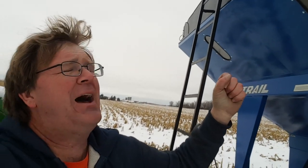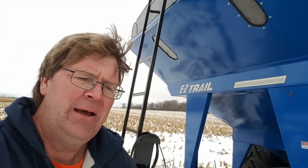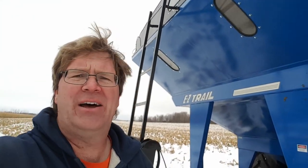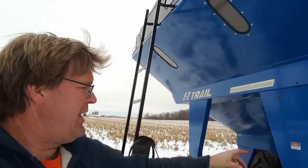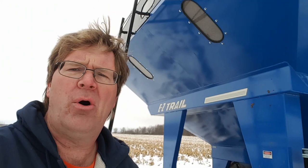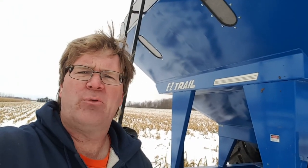In 30% moisture corn with the brand new sticky paint on there — it hasn't polished up yet — it leaves a little bit in the corners, but it ain't too bad. I think there was like a thousand pounds stuck in there last night. With that door open to change from corn to beans, roll the door open, crawl underneath and sweep what you can sweep, then crawl up inside. Kick a couple corners out and you're ready to go — maybe a bushel or two is wasted.